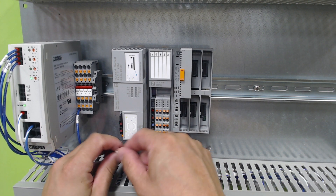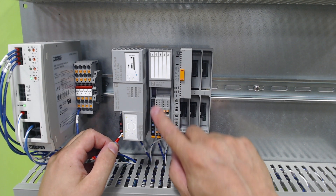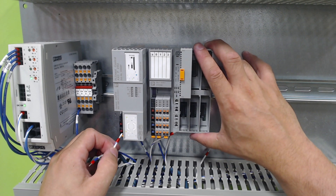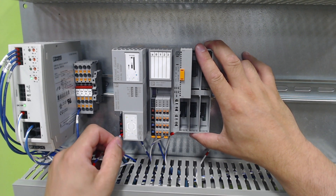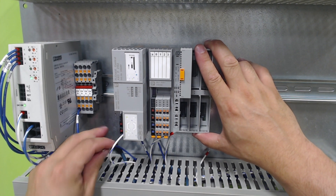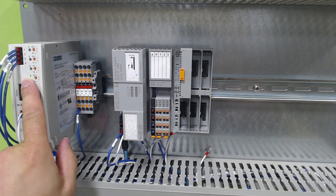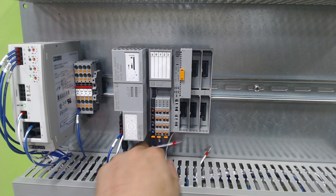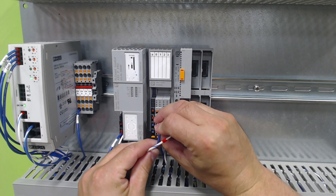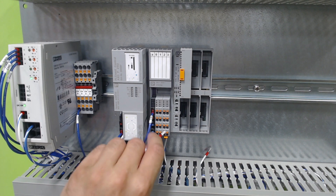On the PLCnext, there are red and blue connection holes — some here and some over here. Red is positive, blue is negative. So we're going to hook our negative up, since they're push-in connectors. We're going to hook our positive up from channel one of the circuit breaker device. Then we're going to go ahead and power our second module — again, positive in the red and negative in the blue.